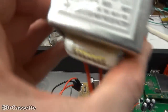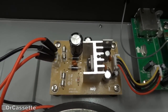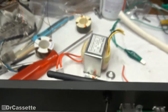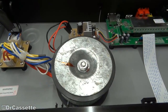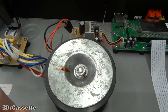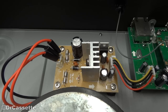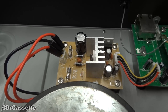The original transformer is 8 volts times 2 split rail, and as already mentioned it has this rather strange two-way half wave rectifier. On the circuit board it interestingly says 7 volts, so that original transformer was apparently not the right one either. This new one is totally wrong by that measure because it puts out 14 volts times 2 — that's the split rail output once used by the amplifier chip of the compact stereo it came from. The additional voltage just gets transformed into heat by the two voltage regulators, which is not exactly energy efficient, but oh well.